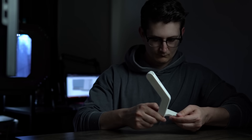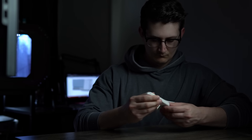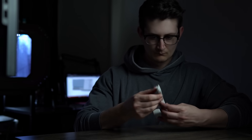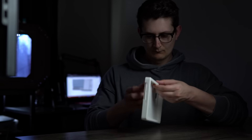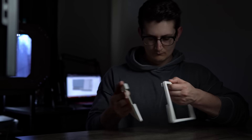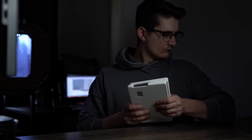One of the first challenges was to get the snap-fit parts to fit together the way that I wanted. I designed everything with tolerances in mind, but the only way to really know how well it would work was to print out a bunch of test parts. These parts needed to be able to press together by hand while having enough holding strength to stay together — strong enough to stay together, but loose enough to take apart by hand without damaging the pieces, which basically came down to tweaking sub-millimeter dimensions until it worked.